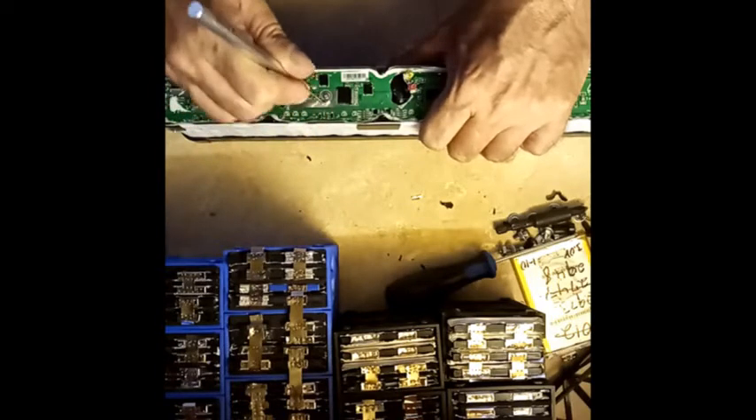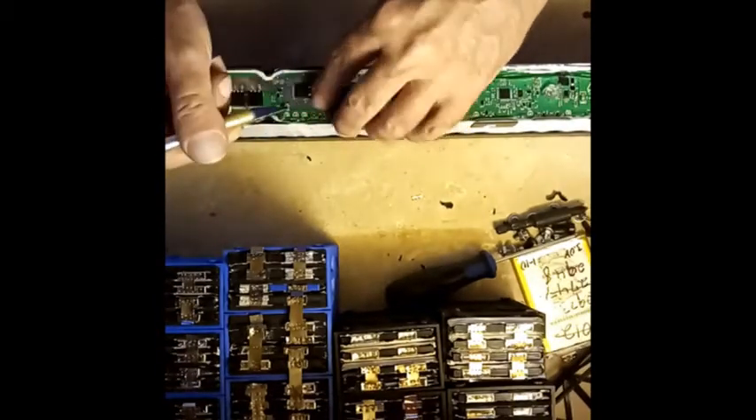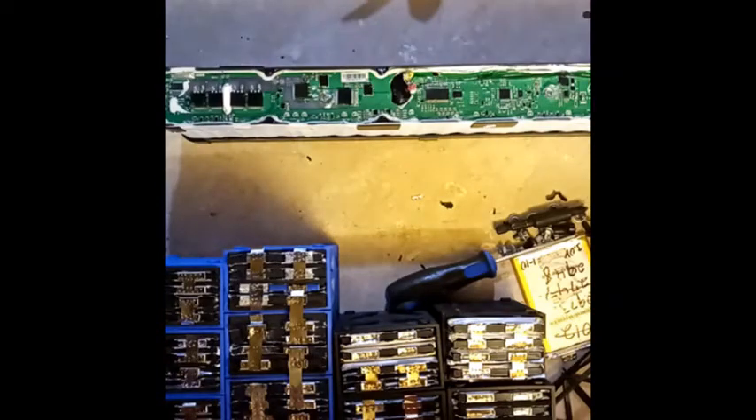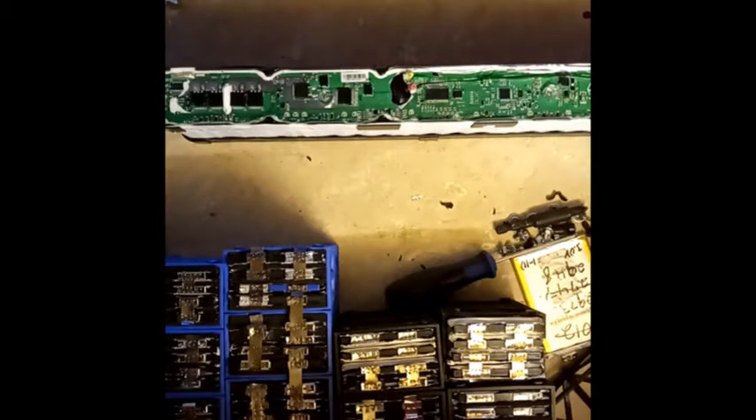Believe me, there are plenty more screws in this thing. These cells are rated at 3100 milliamp hour. From the factory, they're rated at 10 amp, but that depends on how much voltage you want to keep. At 10 amp, fully charged — 9.99 to be exact on current draw in my test — the voltage dropped to 3.5. 3.7 would be more ideal, so when you're building your battery pack you may want to consider these cells at 8 amp and not 10, so you won't lose so much voltage under that current.